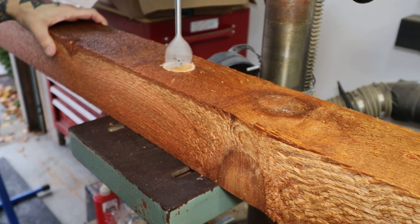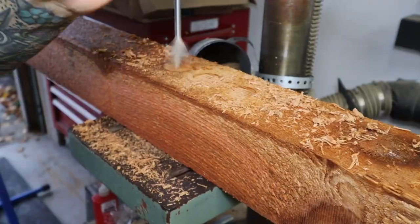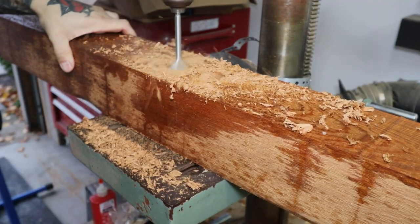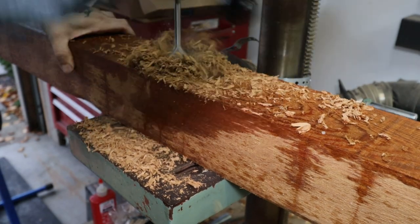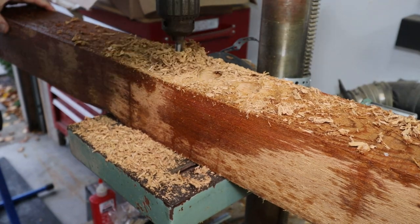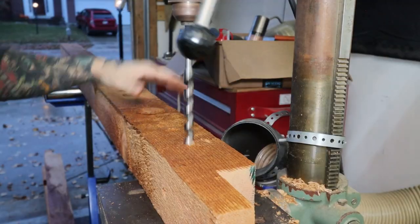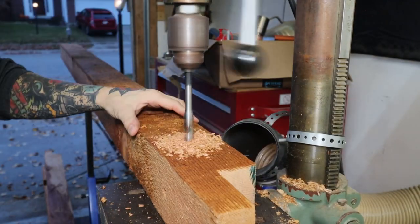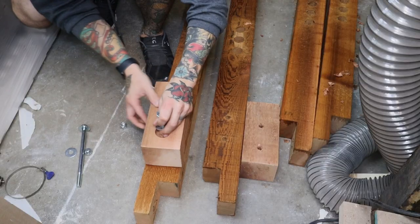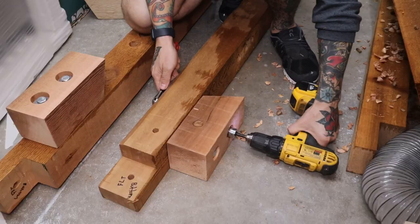For the safety holes, I'm using a 1-3/8 inch spade bit — it helps to have a little extra room for the 1-inch pipe I'll be using for the safeties. I'm only making three height options for the safeties; drilling these holes out is a lot of work and I don't really need more than three. It's super important that these holes are straight so they all line up, so I'm using my drill press. You can use a corded or cordless drill, but it'll be tough to be accurate. Then I drill the holes for my J-cups, which is relatively quick because I've already marked everything. Finally, I use my Forstner bit on the J-cups to make room for the bolts and washers, allowing them to be slightly recessed. Once those are done, I attach the J-cups.